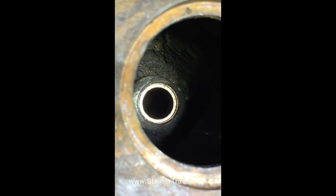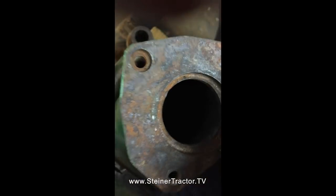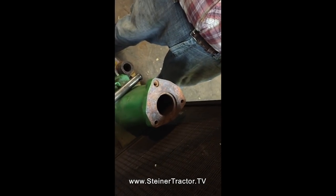So we've driven our bushing down into the bore. It's down in the bore approximately 3/8 to 7/16 of an inch. Plenty of room for us to install our seal. But before I install seals, I want to check the fit of our shaft, because I need to know if we're going to have to ream or hone the bushing.